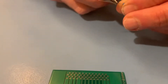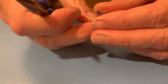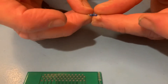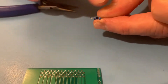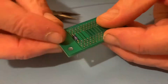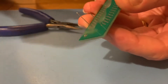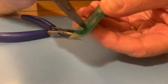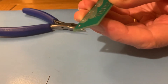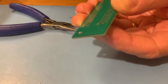First I'm going to fit three resistors in the normal fashion you'd do 99 times out of 100. Literally what I do first is bend the legs — always try and keep the body in the middle with an equal gap at each end. Drop it in so it sits nicely to the board. Keep your finger on the component, turn it over, and crop the legs. I use height cutters — already predetermined at about one millimeter — but most people probably use side cutters. Always cut your legs before you actually do the soldering.